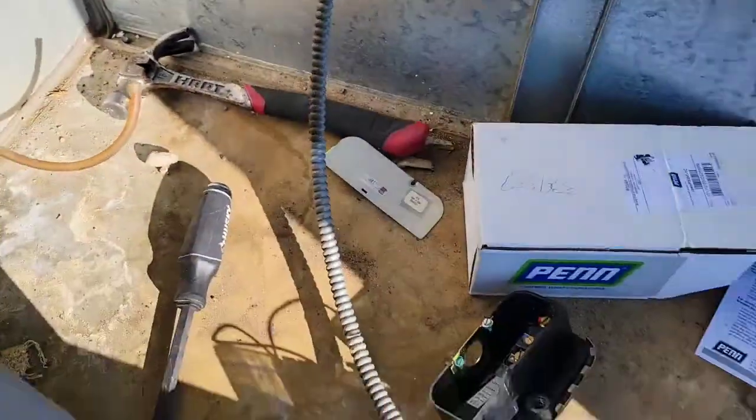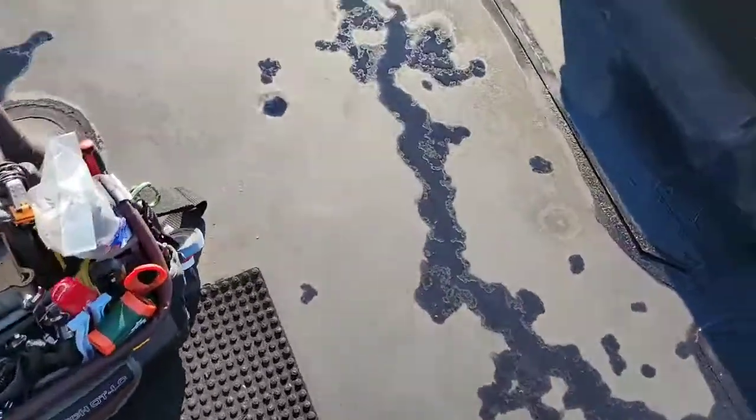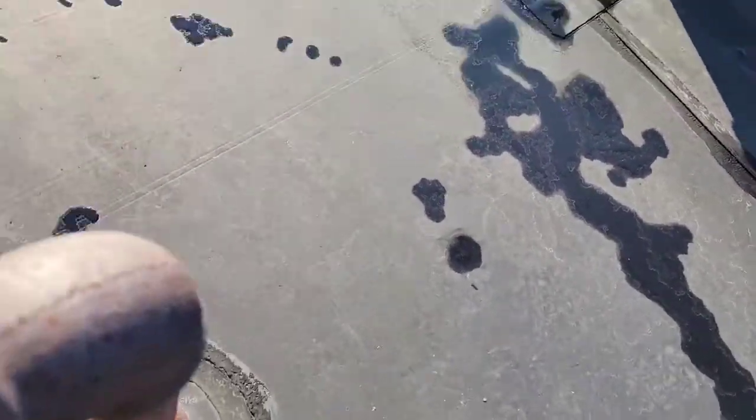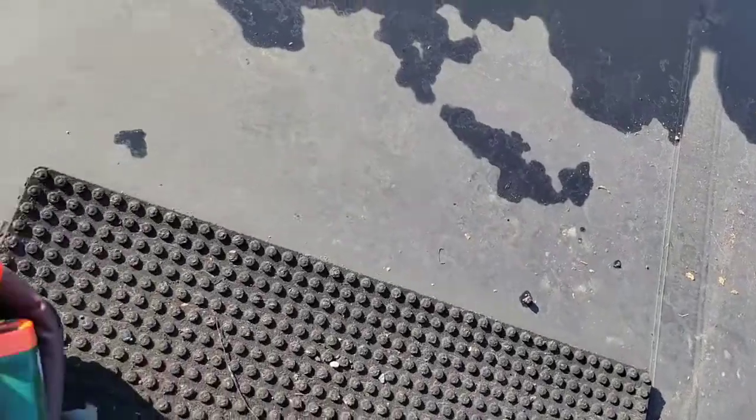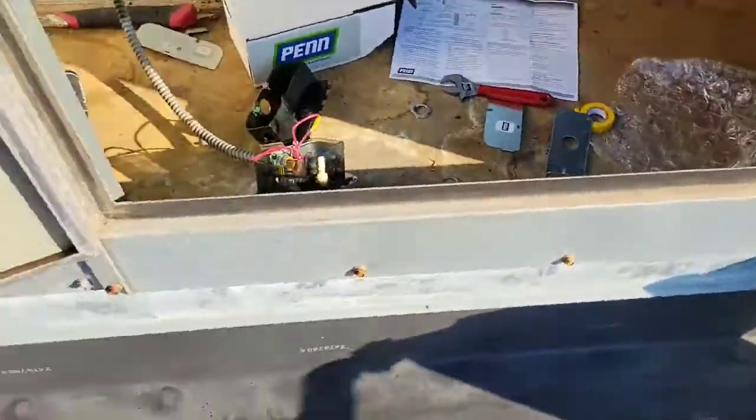Now you could spray degreaser in them. You could take compressed air and blow in them. Just make sure they're clear, that they're see-through. There's nothing blocking them, because that could have caused the issue too. I probably should include that in my first video, that you want to check those tubes to make sure that isn't the issue. All right, and that they are connected properly. You know, that it's connected, one to the high side, one to the low side, and that you can blow through them easy with compressed air or your breath or whatever. And if it grosses you out, then, you know, get compressed air or something. So yeah, just inspect it. You know, there's nothing in there. It doesn't look like there's anything blocking it.